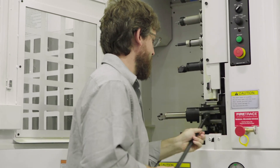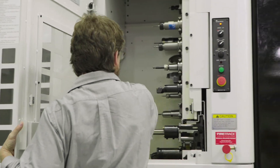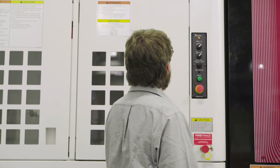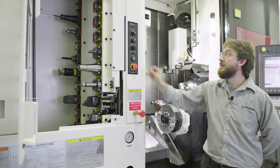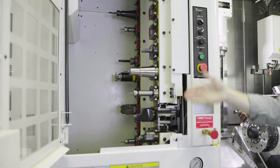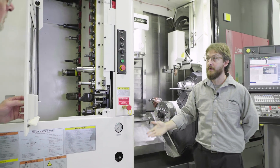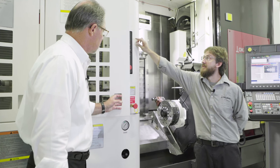Notice the ergonomic placement and ease of tool change while the machine is running. By simply turning the manual interrupt switch, we can access the tool cabinet while the machine runs. Choose which cabinet to go into, which direction to move the chain, and then bring the appropriate tool to the load/unload station to check inserts or tool with. By simply switching the switch back, we give full control back to the machine.